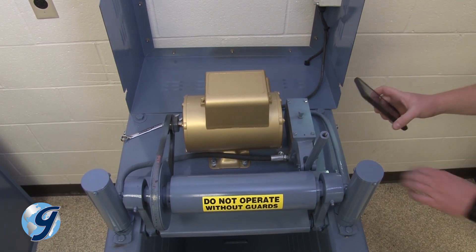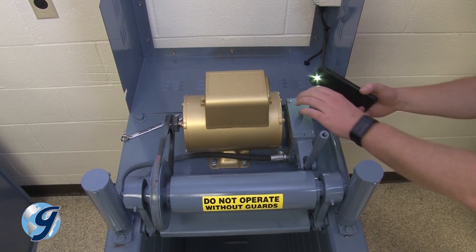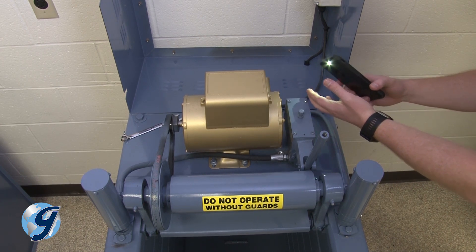Rest the side cover aside so as to avoid placing stress on the load line. While the cover is open, it is important to check for leaked hydraulic fluid, excessively worn parts, and loose or damaged drive belts.